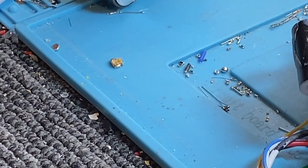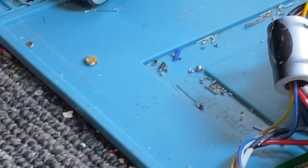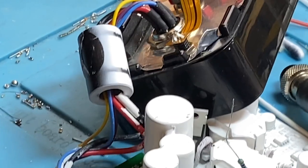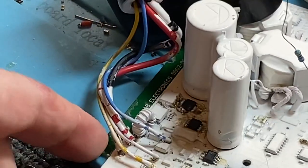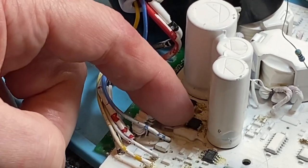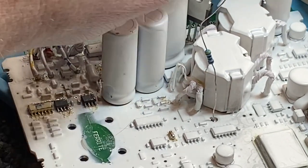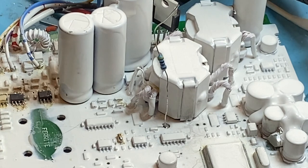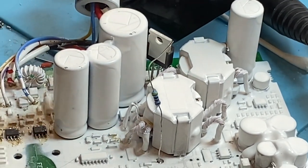This is going to be really awkward the way I've got this set up, because I had it set up to look at other things and now everything's tightened. I had to replace both the 5 volt and 15 volt output stages for the transmit pulses — there's nothing there. The voltage stabilizer for the flyback return voltage was also shorted, so I replaced that.